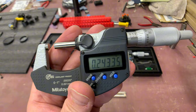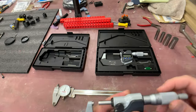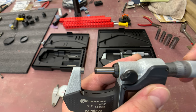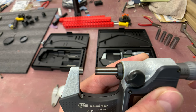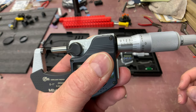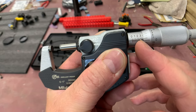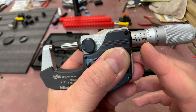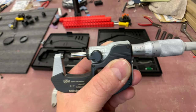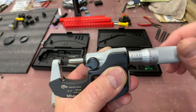Let's do an exercise. We'll go to three-eighths, another nominal measurement. Three-eighths would be three ticks of 25 thousandths past the 0.3 mark. So that's what three-eighths looks like: you're past the three, count three increments of 25 thousandths, and these are the nice round nominal measurements. When you get into the finer detail you start counting the numbers over here, which count the thousandths.